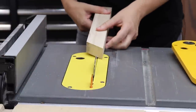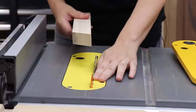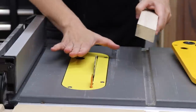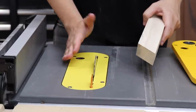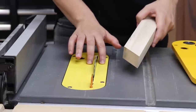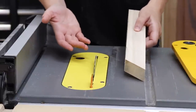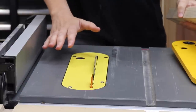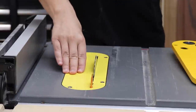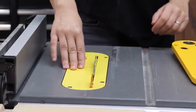If you are ripping thin strips or your cutoff is super small, you have no problems and won't have pieces falling into your saw. Another reason why the zero clearance insert is great is for the quality of cut. Because it is fully supported on both sides of the blade, it reduces tear out and makes for a great cut. And the last reason why I love having a zero clearance insert is for accuracy. This is a very sturdy piece of material and it doesn't budge when I press down on it.